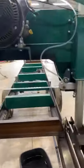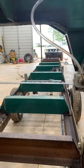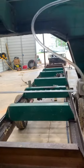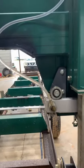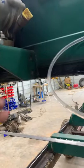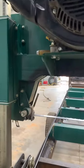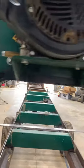I cut a lot of eight inch boards. In order to make an eight inch cant, if I have like a 16 inch cant on my sawmill, that allows me to drop down — I have a full eight and a quarter inches clearance between the bottom and the top of the blade. All I did was take my plasma cutter, cut all the way across and down, then went up under there and capped it back off, welded it back solid. That's about as much as you can go because you get into your motor mount. So I cut it flush with the bottom of that motor mount — it added probably three quarters of an inch, maybe an inch, which is plenty.